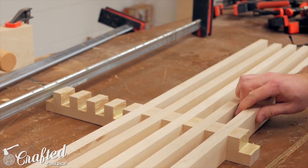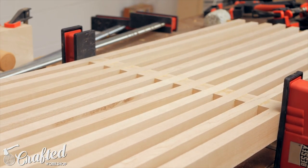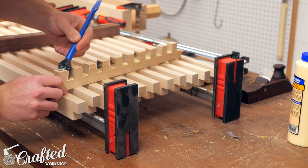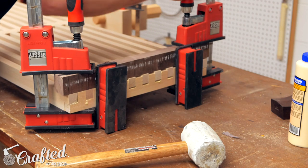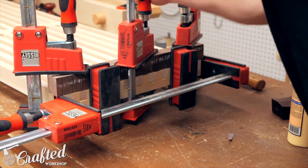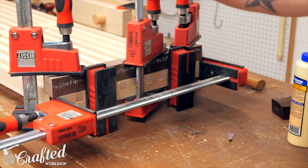With all the pieces for the benchtop cut to size and sanded, it was time for assembly. The glue-up for this benchtop is a little stressful since there are so many individual joints, and I decided to tackle it in three phases. First I glued the center cross member and the slats together. Next I moved on to one end of the benchtop — I didn't go crazy with the glue because of squeeze-out. I got the joint started with the mallet, then applied clamping pressure lengthwise to pull the cross member tight against the slats. I used a hardwood caul across the top of the slats, added a clamp widthwise to close up any gaps, and finally added one more clamp in the middle to pull all the slats closed. Then I repeated the whole process on the other end once the glue had dried.